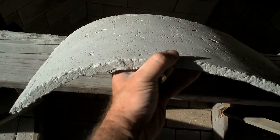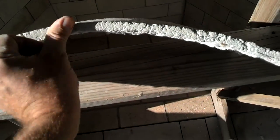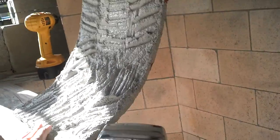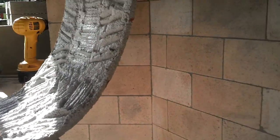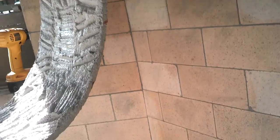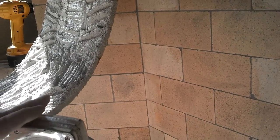Try not to break it — it's made out of castable refractory. That basically is the curve of the throat that goes like that, and that provides the angle that the Rumford fireplace requires for good airflow. The air travels right up in the back side of that profile.